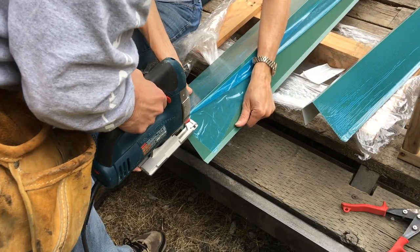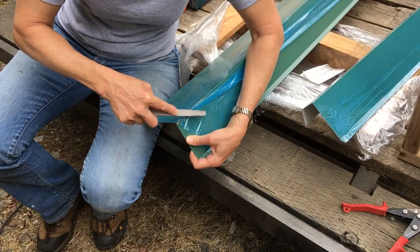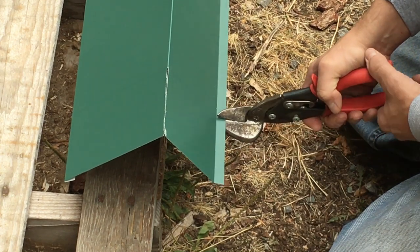The roof cap needs to be shaped at the ends to wrap neatly around the corners. Filing the edges smooths the roughness from the big saw cuts. We're going to cut the flared part so that it can bend around just up to the flare.